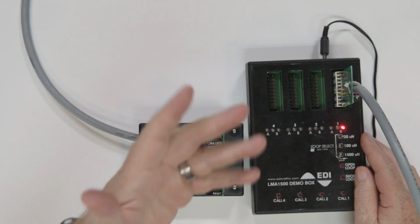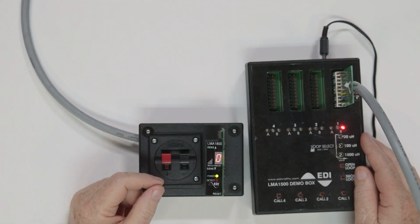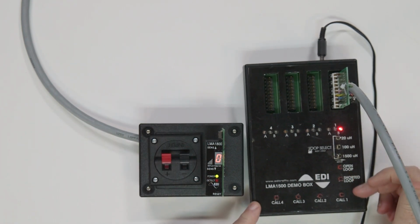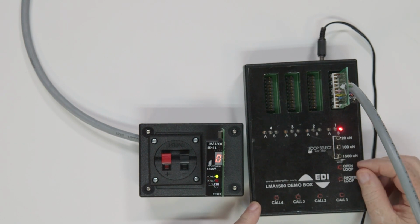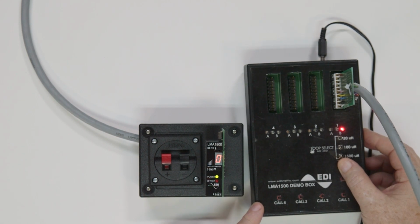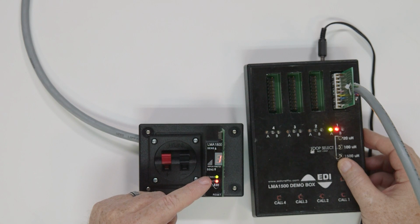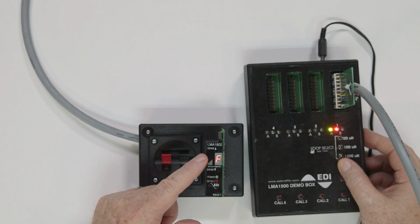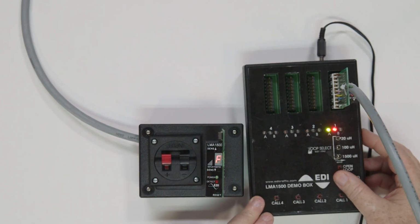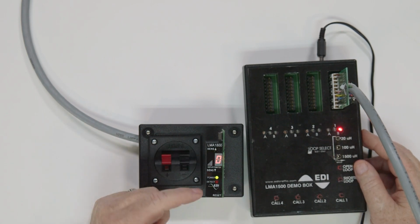The LMA1800 detector continuously checks the integrity of the loop. The system is able to detect shorted or open circuit loops, or sudden changes in inductance exceeding 25% of the nominal inductance. If a fault is detected, the detect LED and power LED continuously emit a sequence of flashes. Additionally, the 7-segment display shows the code F1, F2, or F3, indicating a current loop fault. Each type of fault is identified by a different flash sequence.